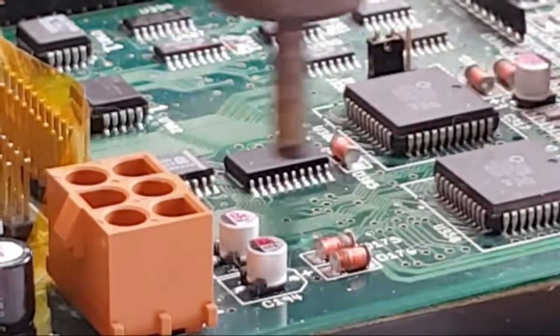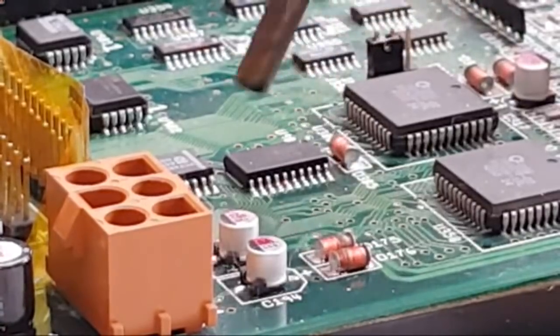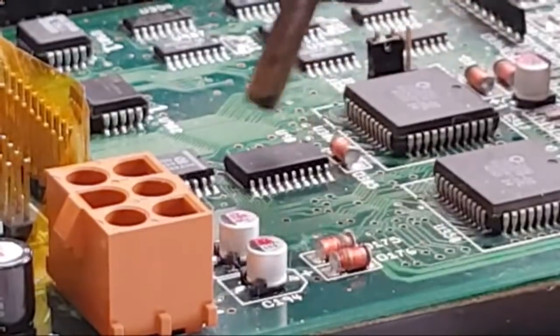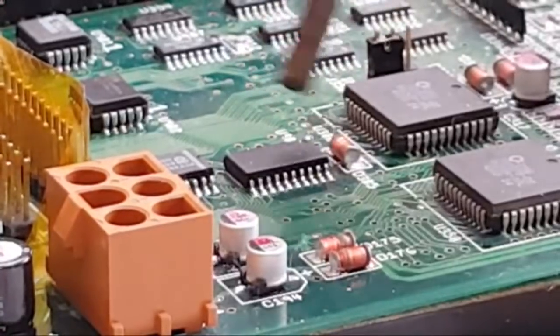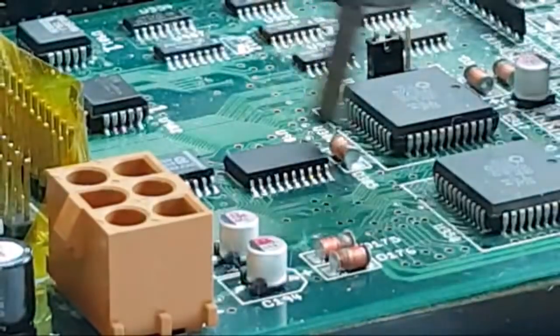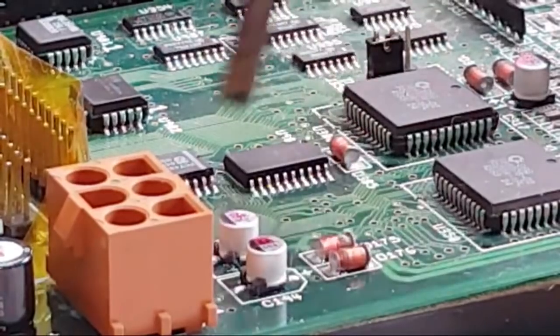But the interesting thing with this one, coming back to the thing about Terminator, this chip here we're meeting up here, this isn't the one that passes the D0 and D1 connections. Hence why this, I think, has still got a long poll time of roughly 15, 20 seconds. But when I tried adding Terminator resistors, this is the board I picked, actually, because the chip there, where D0 and D1 go through, is still a HCT chip. And it didn't work. I couldn't get this to shorten its poll interval.